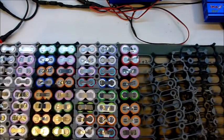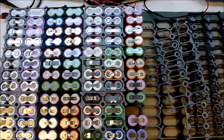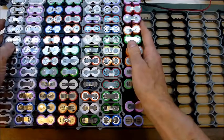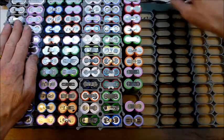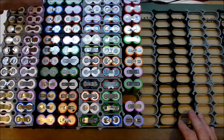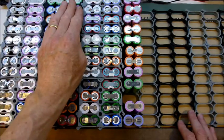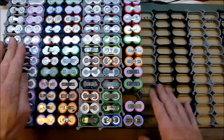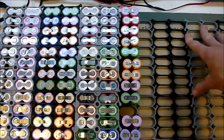Just a quick update on how the battery's looking. I've got it sitting on a slab of plywood to make it easier to handle. I've got basically half the batteries ready to go, but I haven't done the balancing yet — I'll wait until I've got all the batteries. Then I'll do an exercise to make sure each group of 48 has the same total amp hours, so I'll have 7 groups all of about the same amp hours — nice and balanced. There you have it! Thanks for watching, and I'll catch you next time.